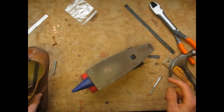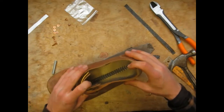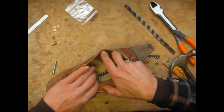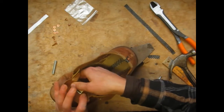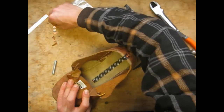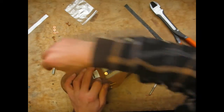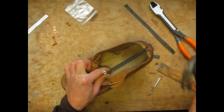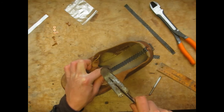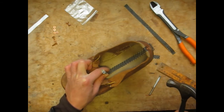You probably don't have an anvil — you can use cement on the floor in the garage or outside. That works just as well, but for example's sake, I'm going to use the anvil so I can show you what I do. We place the washer over the rivet, with the rivet sitting on the anvil, and then we're going to put the installer on and do a bunch of small taps. We don't want to install it super tight — that's going to cause issues. Lots of small hits.